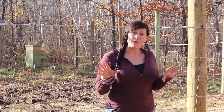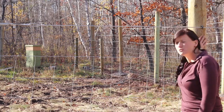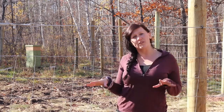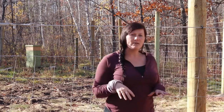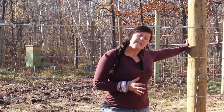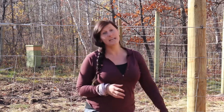First of all talking about the bones — our fence is made of 12-foot treated wood posts. We bury them about four feet in the ground and then put them in cement. Most of our posts are eight-inch diameter and then the ones in the four corners are 10-inch posts, so we've got some really sturdy starts.